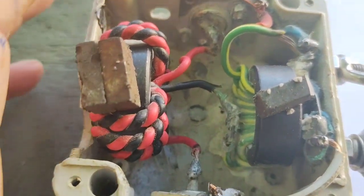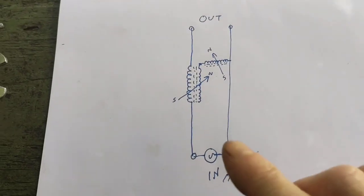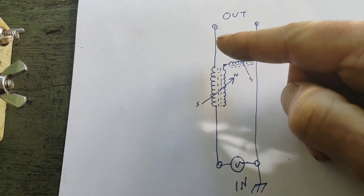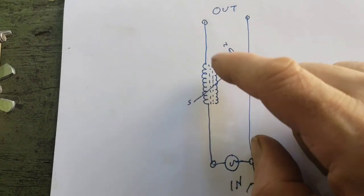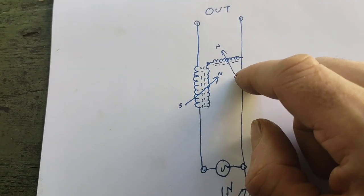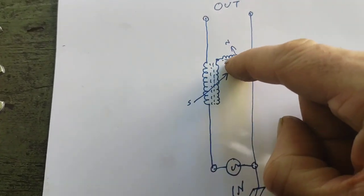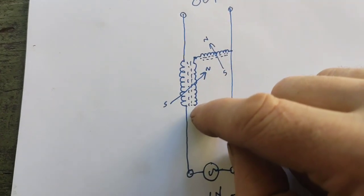Essentially, if we look at it this way: we have our AC source, our active and our ground reference, and we're going nine turns through to the output on a ferrite. In order to get the opposing sign — normally the capacitance would provide that — I'm tapping the inductance from the opposite end. The other end is not connected to anything, so it's floating.